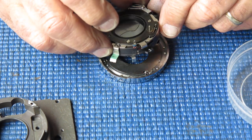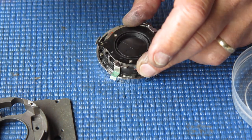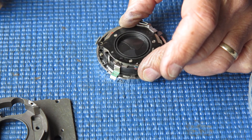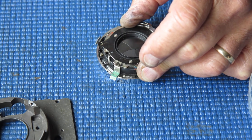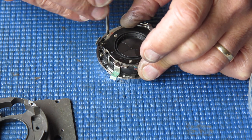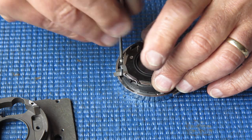I'll put that detent ball in place and the shutter fits on in one direction. I'll just get that lowered into position and I'll cock it while it's held there to make sure that it engages with that gear correctly. If you don't check that it engages correctly with the little pinion gear, you'll end up with the pinion gear getting trapped underneath the teeth of the ring that drives it, which will damage things and of course won't work either.